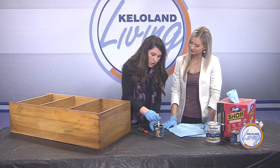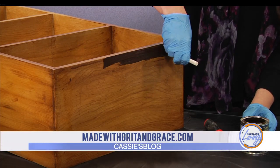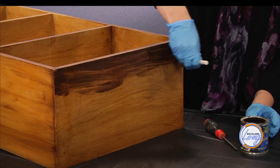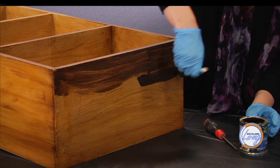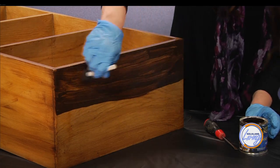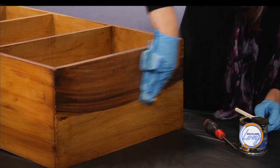I like using a foam brush to get the stain on. This stain is unique because it doesn't absorb into the wood like a typical stain — it's more like a translucent layer that goes over the surface. I like to do a nice thick layer on top, let that sit and cure a little bit, and then wipe off the excess. It works a little differently than a traditional stain on raw wood. Always work with the grain of the wood, then take your shop cloth and go back and forth to wipe off the excess. It's very forgiving.